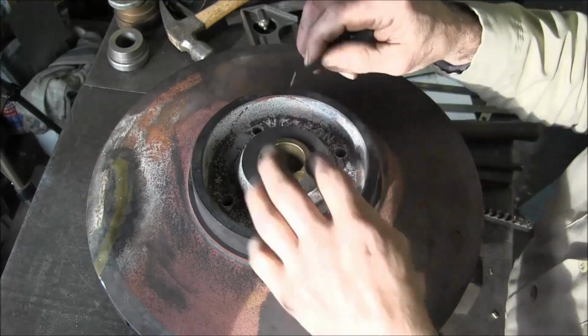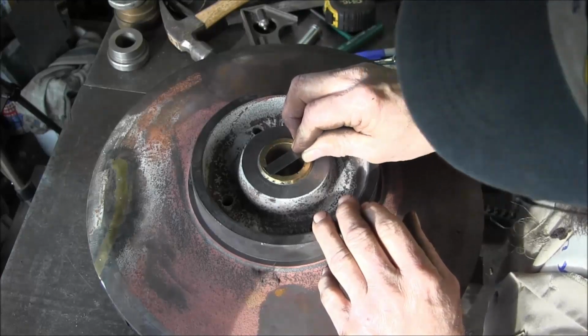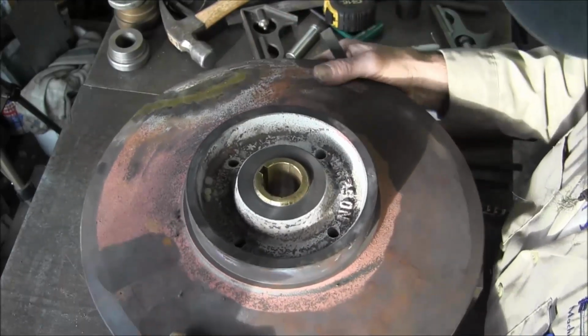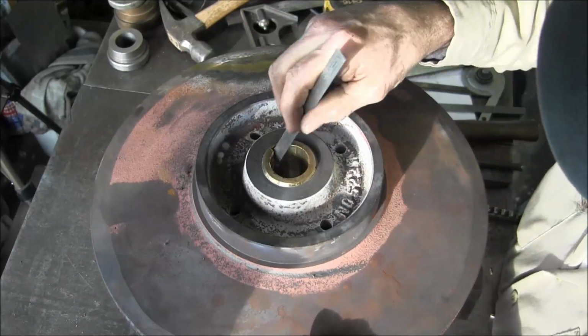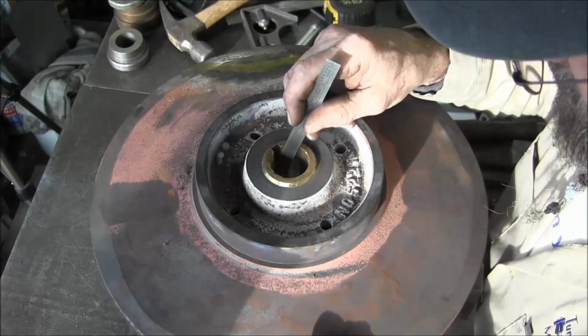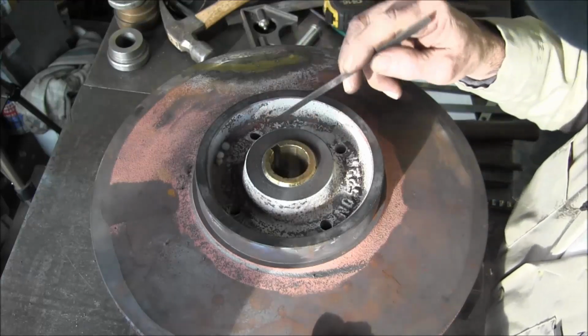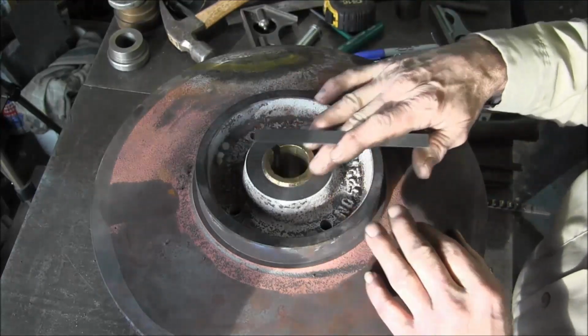Yeah. Alright, spider webs. Alright, our keyway is complete. And what's nice too is all the way around, all surfaces on that keyway, we've got the bronze. Now there's a couple little porosity spots in there, but we're not really concerned because we got a good fit all the way around here. Alright, we're going to deburr that.